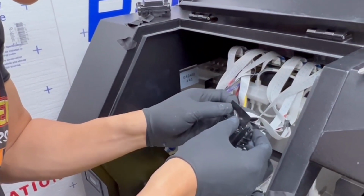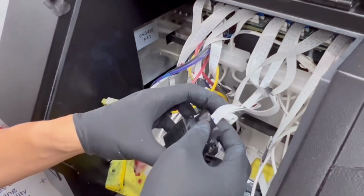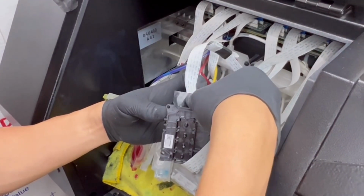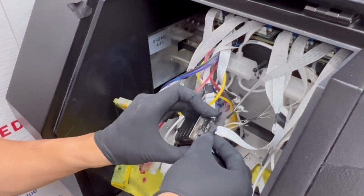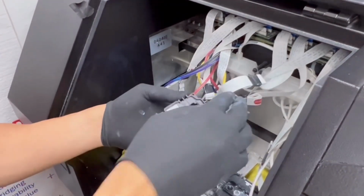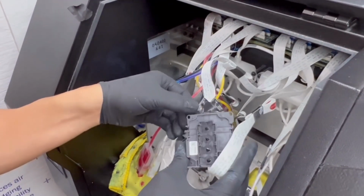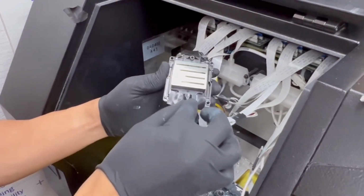I always start from the middle, making it tight, making it flat. You want to keep this hole exposed because that goes into the groove. Fold the corners in. I'm going to go ahead and tape half of it. Start from the middle, flatten it out. Fold the corners in. Lastly, go to here. Fold the corners in. That should be now waterproof. Flatten it down.